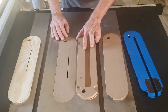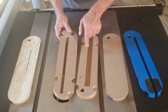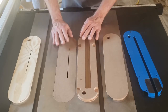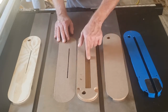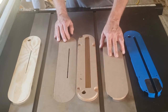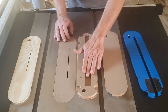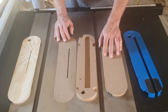This insert is big enough for a dado stack. These two, with this cutout right here, will allow you to keep a 10 inch blade — which is what comes with these saws — to make your initial cut. This one doesn't have that cutout, which is good if you have an 8 inch dado stack and are running an 8 inch blade. Without the cutout it's stronger, and you don't need it with an 8 inch blade.